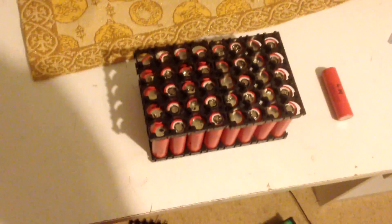Now you want to put these cell holders in, and then I'll get to soldering these. The essential process is putting a bar across and then fuses going to the positive in series. I am now in the shed and I have put together the battery pack by locking down the plastic holders, so now it's all one big solid, rigid pack.